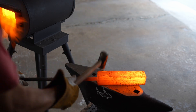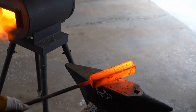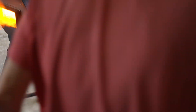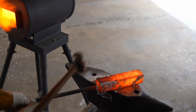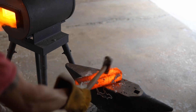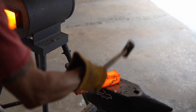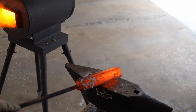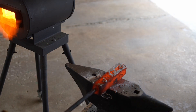Here I'm trying to set the welds — I probably should have had that metal a lot hotter, putting some flux on there. And you can see the back end really isn't at welding temp, and even the front end isn't anymore. So then I switched to the press, and that's when I ended up getting it to welding temp for sure.